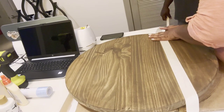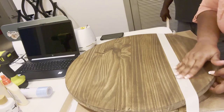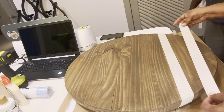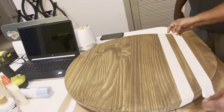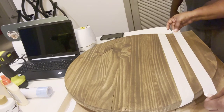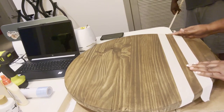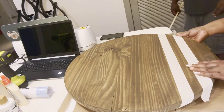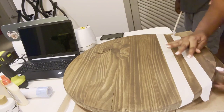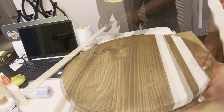When you paint, the paint can sometimes seep under the tape if it's not on good and flat. You have to make sure your stain is dry. In between, I waited an hour and made sure my stain was dry. You could use a hair dryer to speed up the process, but I just waited an hour in between and then waited about four hours. I'm making sure I press those edges down really, really good because I don't want any seep through — I'm using black and it's going to show. I'm just pressing it down really taut to make sure nothing gets through.